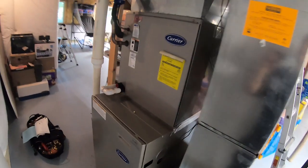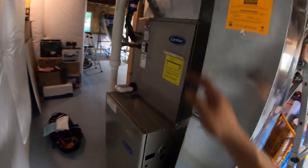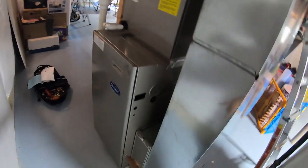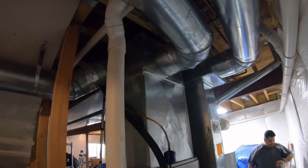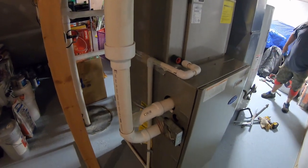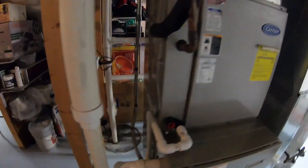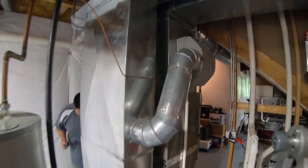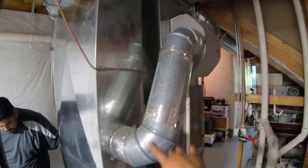This is a four-ton package swap — four-ton case coil, four-ton condenser, 100,000 BTU furnace. This is what was originally there. It's a good brand — Carrier. We started taking it off already. This is a before shot. Same thing in the back of the unit, same thing — bypass humidifier.